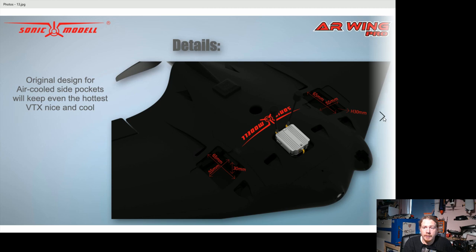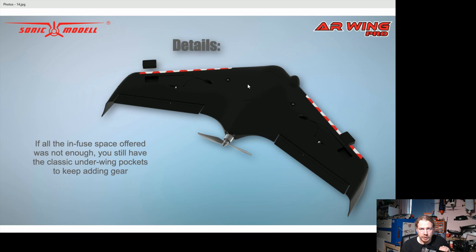Looking at the bottom, we can see the extra wing bays. There are just two screws to hold the wings in — they stop them pulling apart, which is great. You can see the cable for the wing-mounted bays. Personally I'd put my VTX and receiver in those wing bays, maybe with a little lead on the receiver side to balance the lateral weight against the heavier camera side. The biggest problem with that concept remains the connectors.